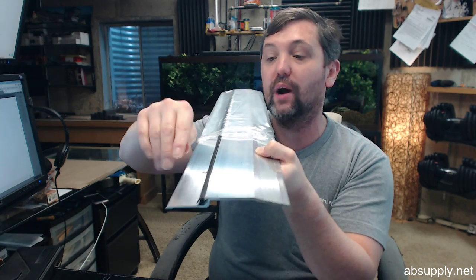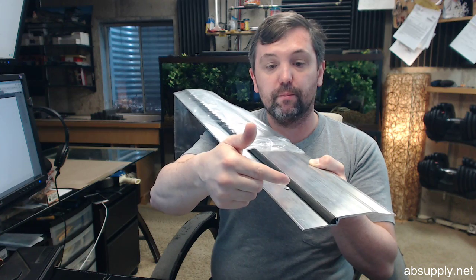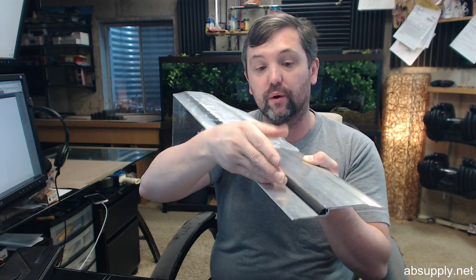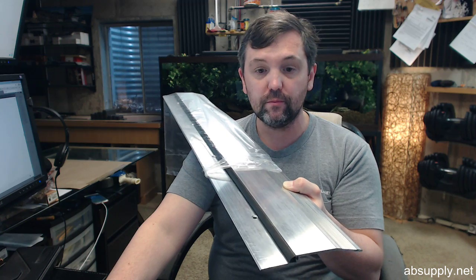You're really attempting to stop it a half of an inch further out, or even greater than that. Like I said, for an outswing door, you'll certainly want to add a door sweep out here to help prevent the point of seal, which is already on the interior of the opening if this is an outswing door, from allowing the weather to get so far into the opening, okay?